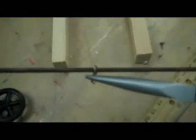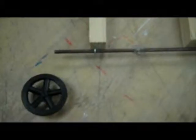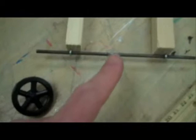That's all. For my back axle, I'm going to take the clip, take a pair of pliers, and I'm going to twist it on there as hard as I can and put a little bit of hot glue to secure it. But you notice it's in the middle of my axle, and this axle will go in the back, the furthest away from the mousetrap. Very important. Put your axle in, especially the one in the back, before you put your wheels on, because you can't put your wheel on. You have that clip that will not go through these little eyelets. Very important. Put that in first.